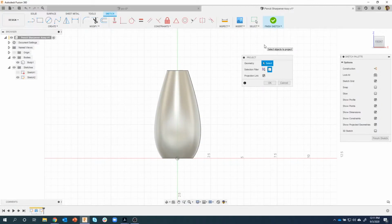Okay, Brad stumbles. How does he solve it? Okay, I'm clicking on the body and nothing is happening. And I thought, okay, maybe the sketch was turned off or whatever. Well, it's asking for me to select something. So I'm going to go up to my select menu. I'm going to go to my selection filters, and you'll notice that nothing is checked except for select through, but it's not selecting bodies or select all. If I change that, okay, now you'll notice it's recognizing this.